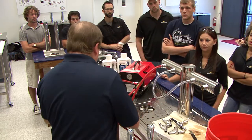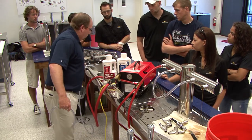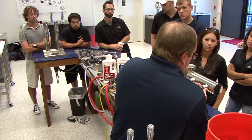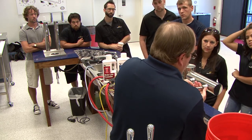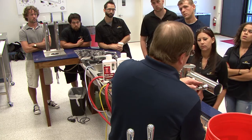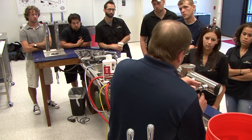One important thing we forgot to talk about in the classroom is that on opposite weeks — in other words, if we're cleaning today, two weeks from today we're going to start from the opposite end. So we're going to have reverse direction, which reverses the flow in each line. In this case, two weeks from today, we would clean from number four — we would hook our machine up to number four so we get reverse direction. That's really important.